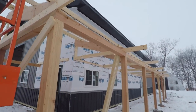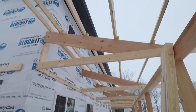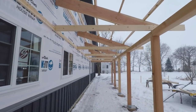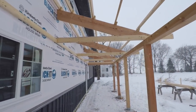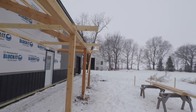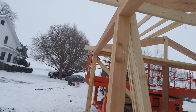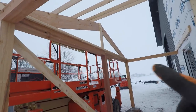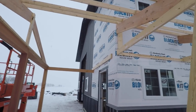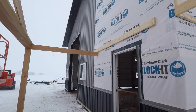Got a lot done here by myself tonight. Snow's starting to come down so I'm going to have to call it quits. Got all my rafters, my bottom cord's done, most of my purlins done. Tomorrow, if I get a chance, we'll come back, string that line, snap our fascia, do some more framing on this end. Going to get all of our ceiling framing done so we can run that and sheet the roof — that'll be the next stage.